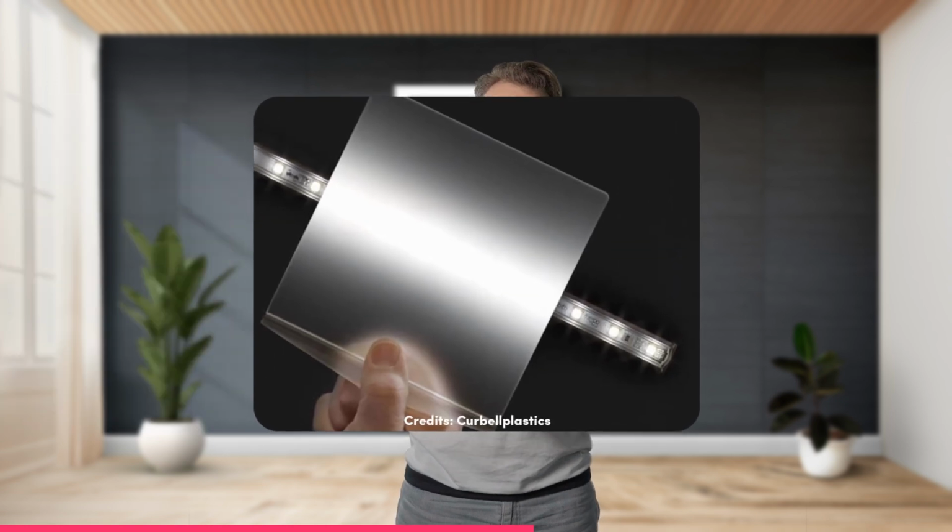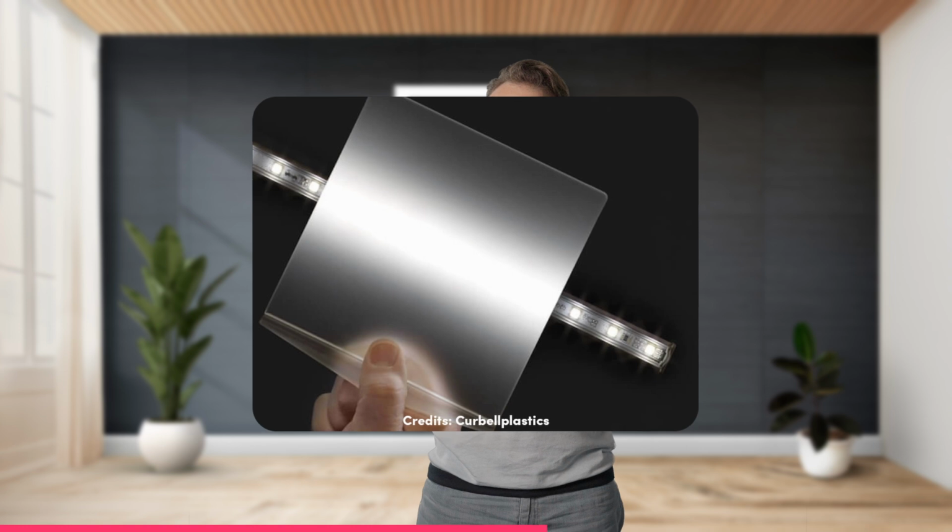And that you can do with less translucency. But if you decrease translucency a lot, what happens then is that the RGB lights don't really get through anymore, and it feels like a very dark, not so bright device anymore. So there is a really fine balance that we had to find, and it's been going back and forth.